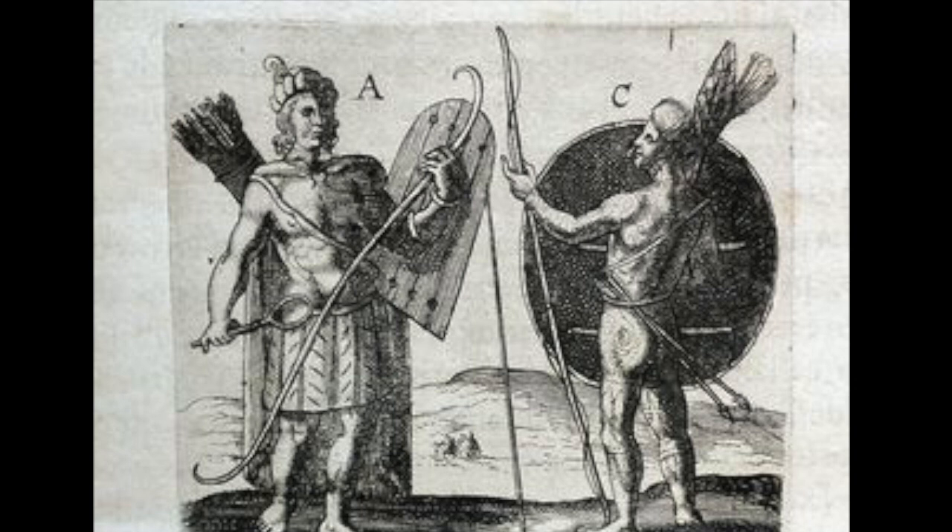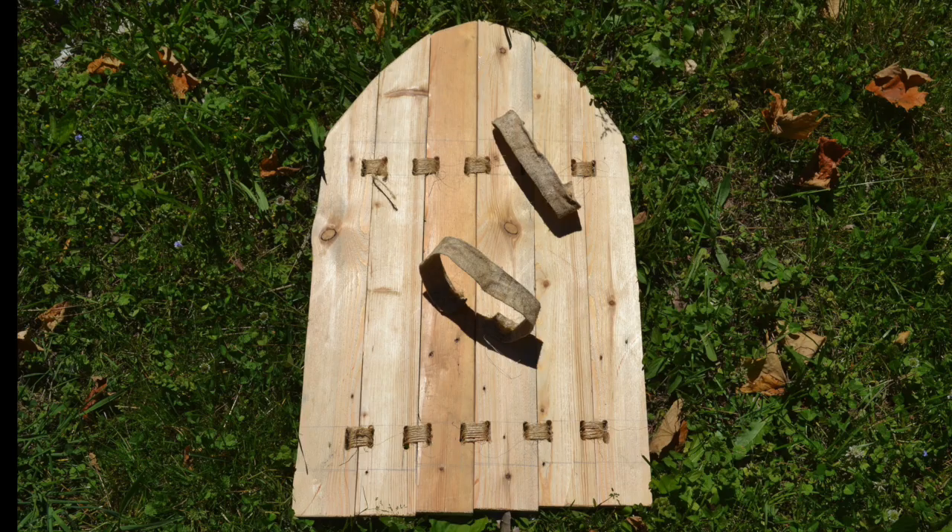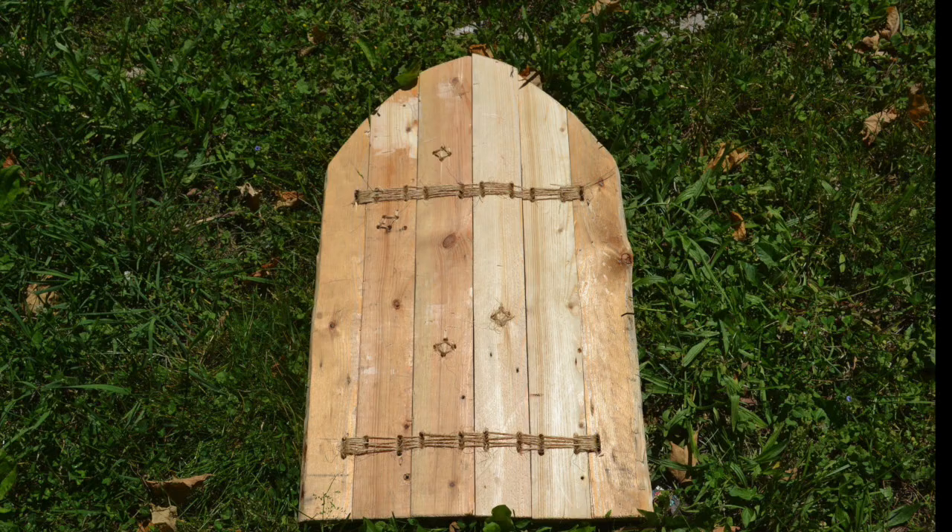I'm going to start by trying to make a reproduction of the shield shown on the left. Although it doesn't match the descriptions, it could be that the early writers just didn't catalog every variety. So I did a number of experiments and tests until I found a design that worked and matched the illustration. I used pine for the boards because it was what I had to hand. I tried to match the back of the shield as closely as I could, but did as little as I could to the front. It's likely that the shield in the illustration had the front covered with rawhide. The rawhide would have had the double effect of stiffening the shield while at the same time preventing it from splitting.